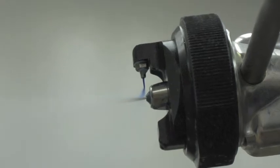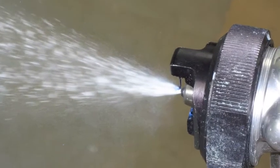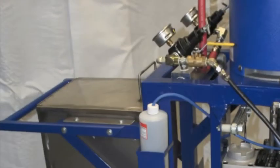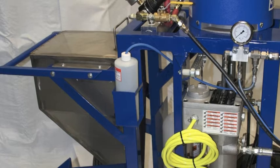This eliminates the typical 30 to 45 minutes of working time when applying conventional methods of pre-mixing the vinyl ester resin and catalyst together. The precise mix of the plural components also eliminates uncatalyzed and over-catalyzed sections of sprayed-on product.